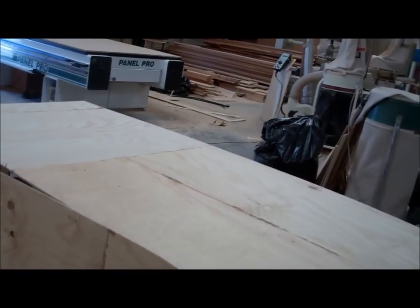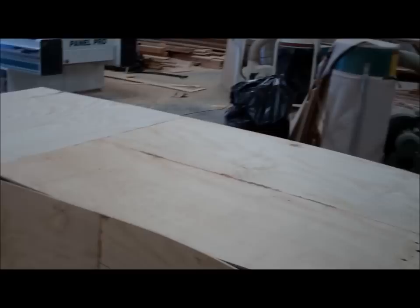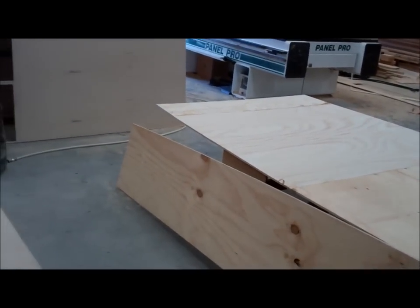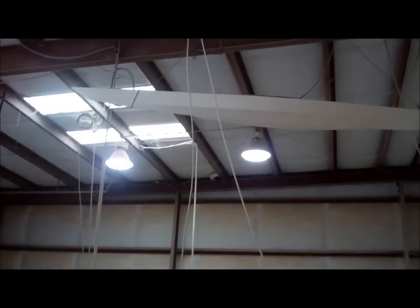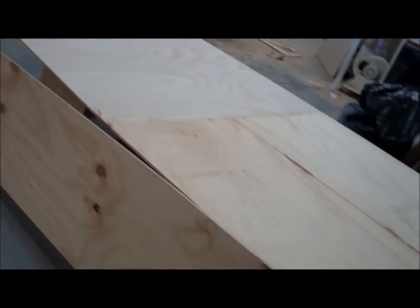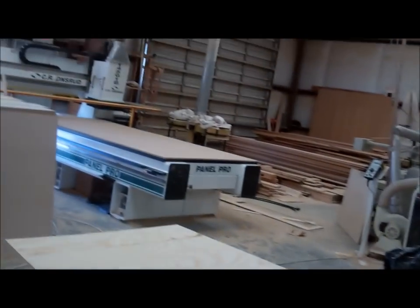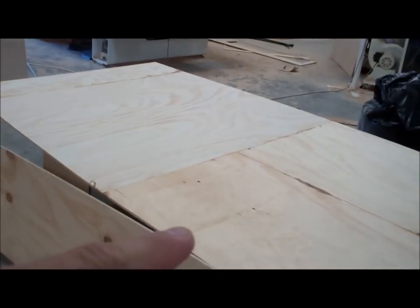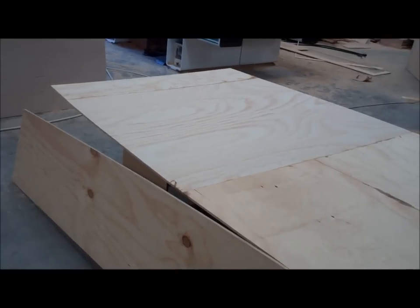The main piece has dried — the seams — and I flipped it over, got it on a couple little benches. I was going to use a technique called sewing where you drill corresponding holes in each piece and actually use wire and sew it up — that's how I did the kayak because the plywood was so thin. But I'm going to try to nail this, start down there and just work it down with some small finish nails and see if I can get this thing to form up. I may have to surface that on the CNC to make it thinner if I need it to flex.